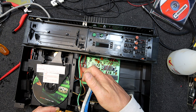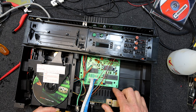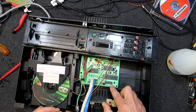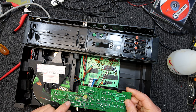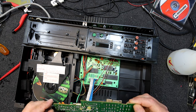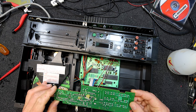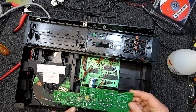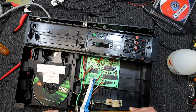That's all the deck connections. So there's MAB8441 - that looks like the micro, but it has got its own crystal. That's possibly a memory chip I would say - M5M4416 something like that. Several of these go back to this connector - that's the other LED. So one of those LEDs is hooked onto the pins of that, which is interesting, and that hooks the other LED to some sort of common line. So that LED's multiplexed - it must be in line with the rest, with one of the segments on this display. The other ones go through a couple of links back to this white wire.